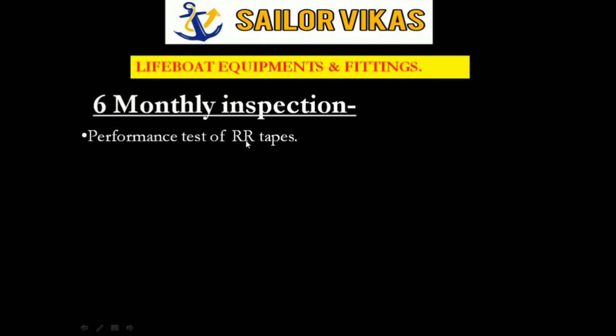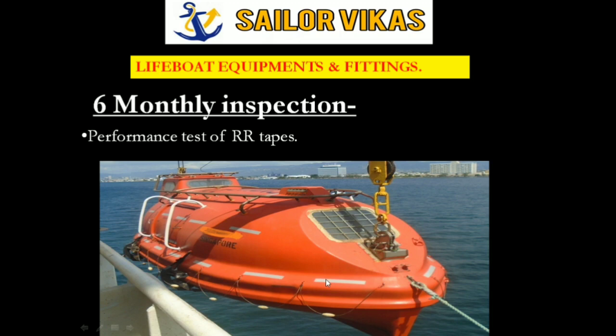So if you can see here, these RR tapes, retro reflective tapes, you have to apply some water here, and then keep one new retro reflective tape beside that, and apply a torch from a distance of 10 meter, and you have to see whether they are showing the same illumination or same intensity of brightness. If it is faded, you have to change it. So this is a 6 monthly inspection, but if you have any doubt, you can renew that immediately also.